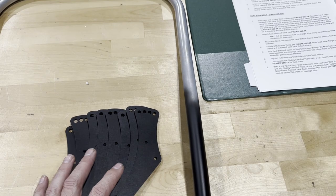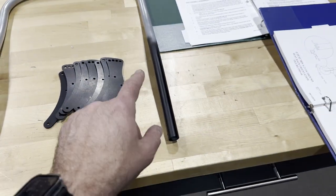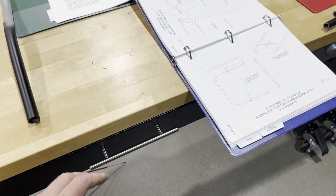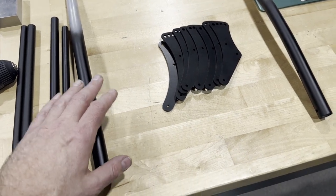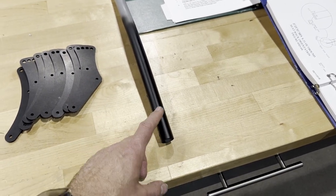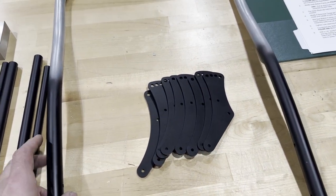I'm going to start working on the seats today. Got the parts laid out. I went ahead and primed and painted the lower end of the seats. There's a little bit of the seat tubes that are seen outside of the upholstery, so I wanted to black those out. I used a two-part epoxy primer, and then I used a two-part urethane satin black automotive finish for those.